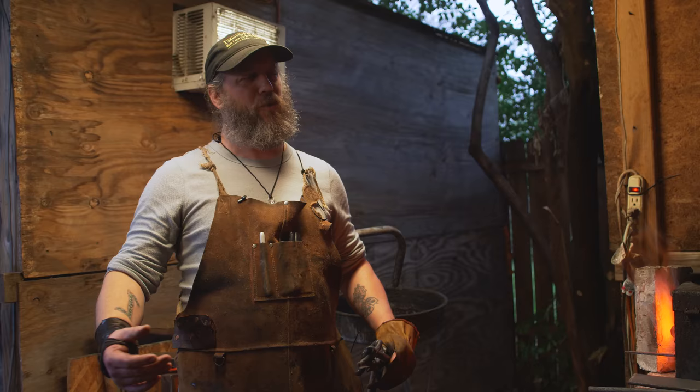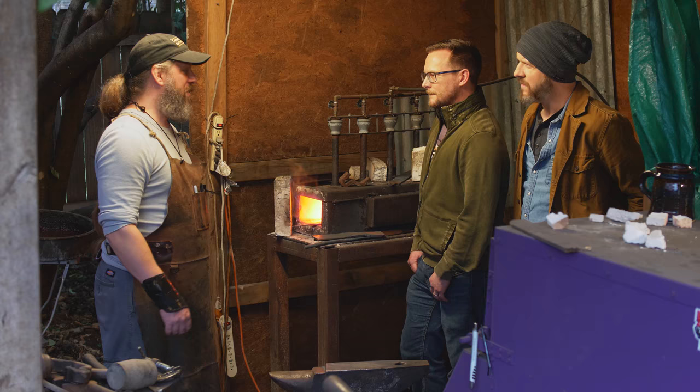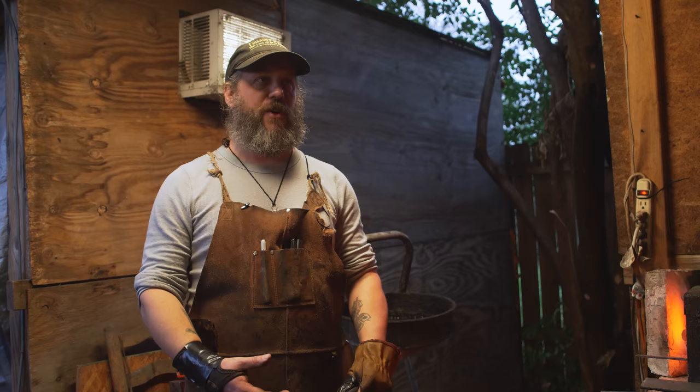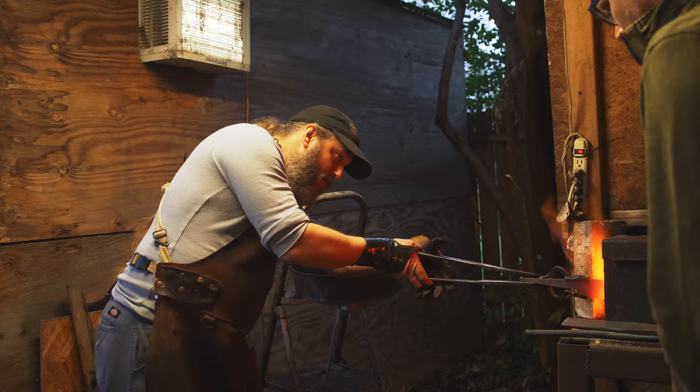We're taking all the stress from making the blade and we're trying to remove as much of it as possible. This is a step towards that. We're doing a little bit of that now. And we're gonna stress it again when we heat treat it, because when you cool the steel, it's very stressful. It creates a lot of stress within the metal and the material. So when you cool it, if you haven't done this appropriately, you could end up breaking your blade. Yeah, actually, that's exactly why we do this.